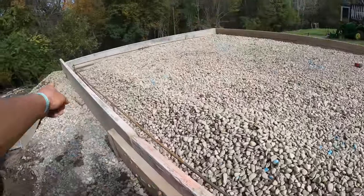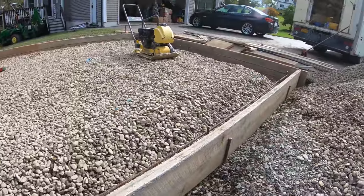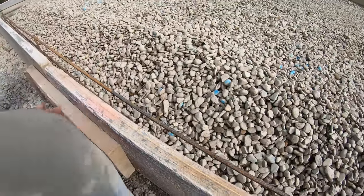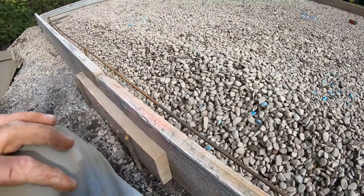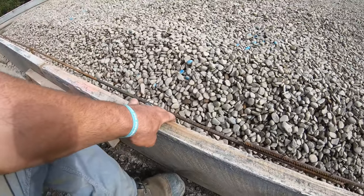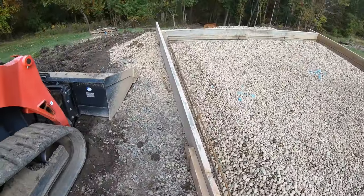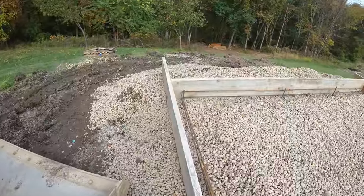But in the center of these boards on each one, it's called, and I think I invented this, it's called a preload. I put a half inch. This board is actually bowed in a half inch. The minute we pour and that water sets into this wood, she starts to bow out. And we watch it and it goes dead even. I've done 100 of these. I've got it scienced down.